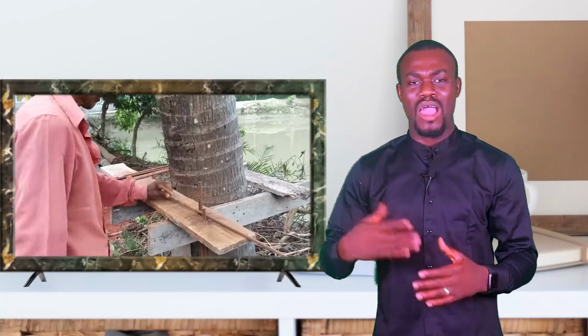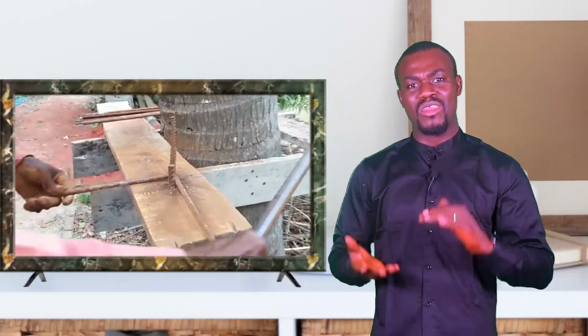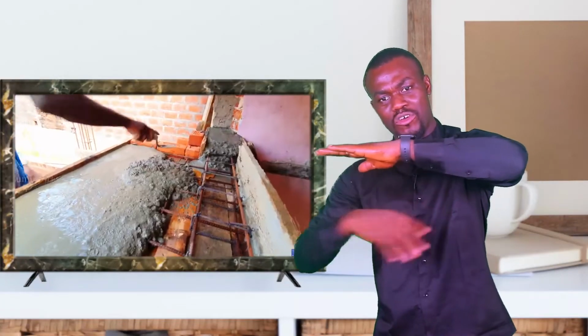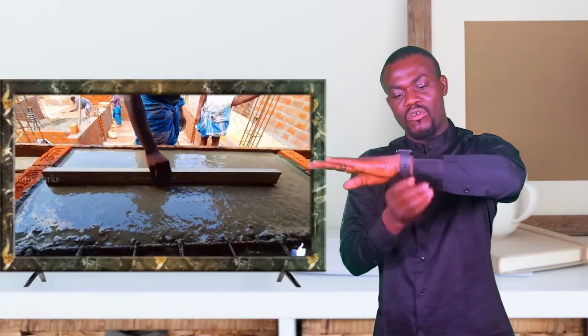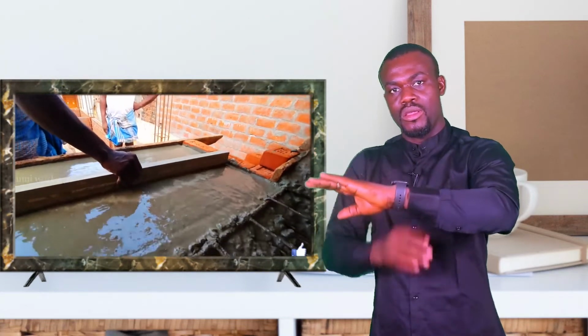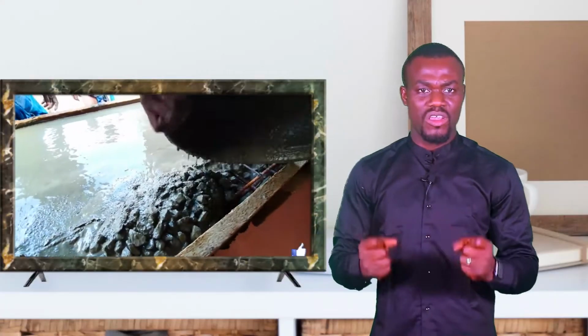Your iron bender or iron worker comes on site, places the reinforcement, ties them together, then you begin to pour your concrete inside. So the reinforcement is like a buffer to ensure that even though there's a void underneath your stamped concrete work, tomorrow, 5 years, 10 years from that day, someone steps on it or drives on it with a heavy pressure vehicle or trucks, the reinforced concrete makes it such that the concrete doesn't break and cause a pothole, or crack and deface your entire work. So it gives added strength to your floors when you add reinforcement.